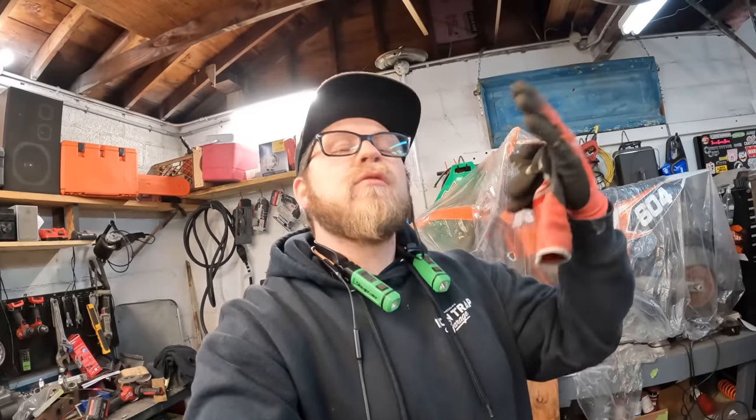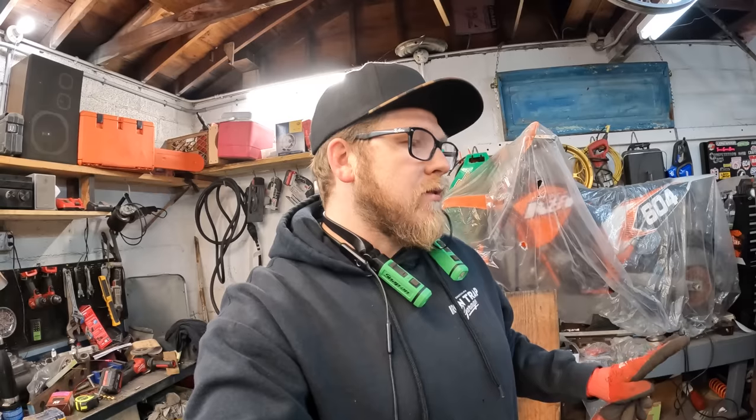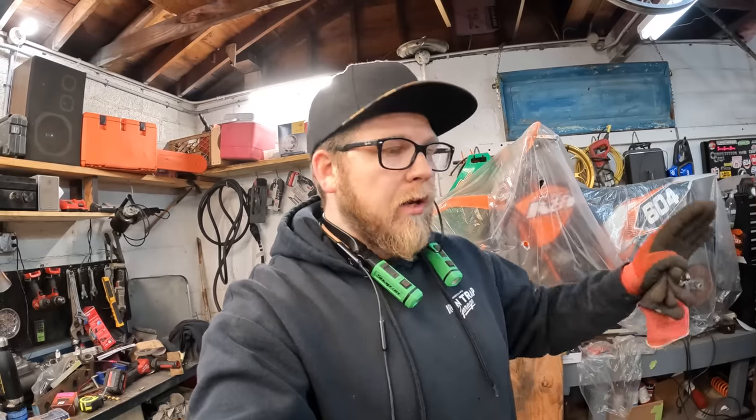I had to put jack stands under the front and then slowly work it back to get the front up. Instead of using shims, I just simply used the jack stand itself and the curvature of the frame and just moved it back to bring up the front to where I could get it as close as I can, again, without having a frame table. So now that this is good, I'm confident and I can start the process of building the back half of the frame.